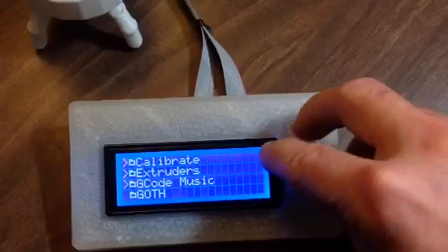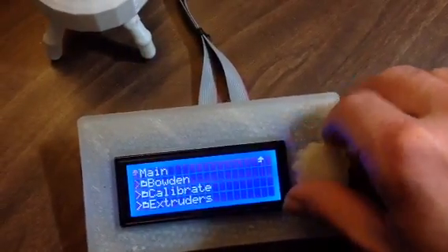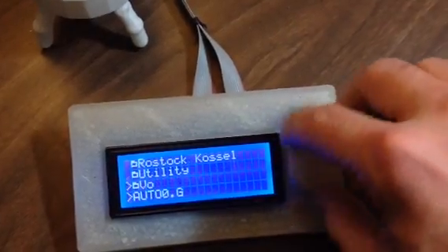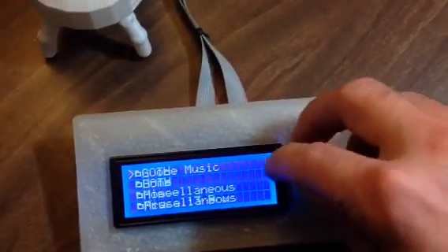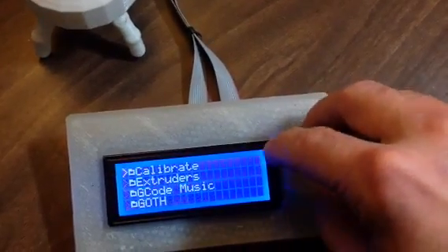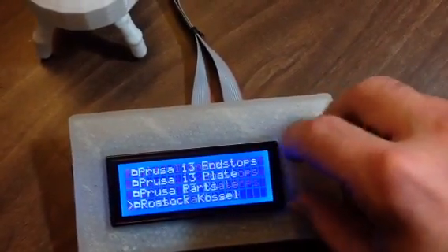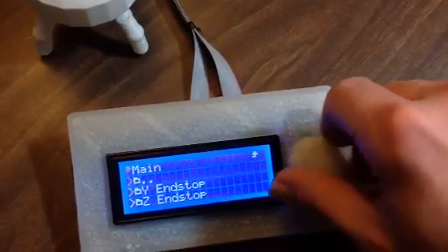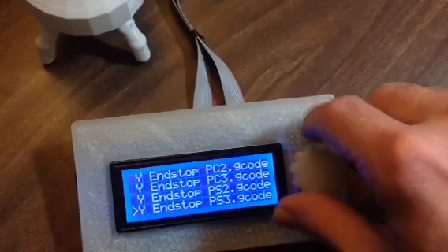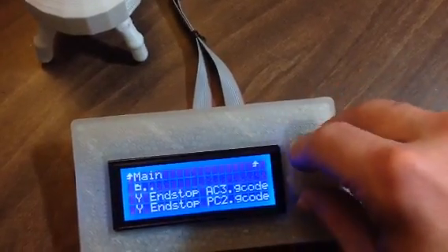When you start printing, it actually clears the cached listing out so it frees up that RAM. A listing over 3K long would be a surprising number of characters — that's a lot of files to print. So that's one of the other things. Also, folders are listed above files, which is an option you can set in the configuration ADV file.